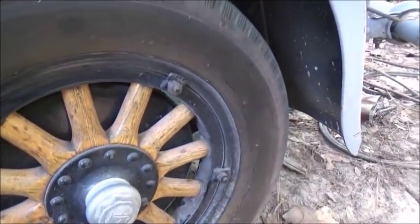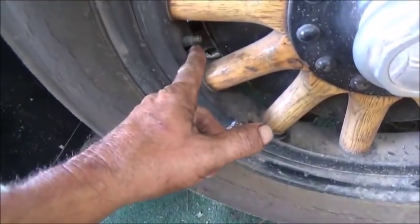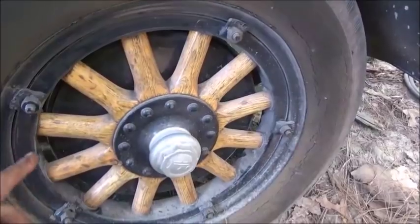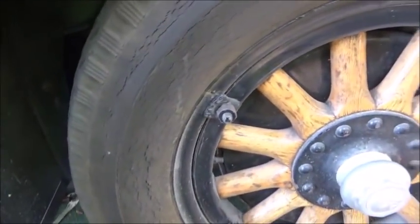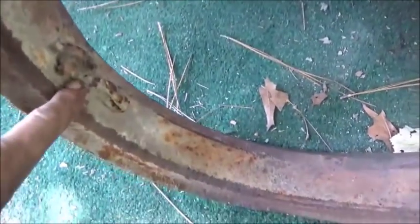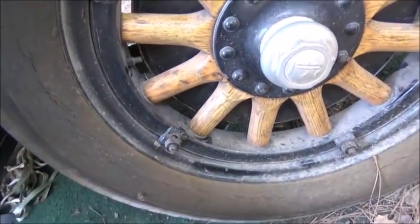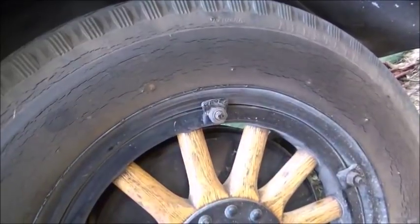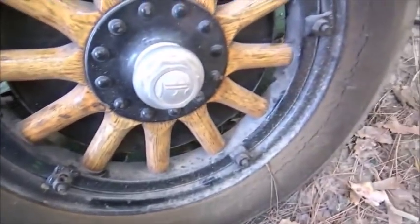The bend radius on the original is a short bend compared to a newer rim. But if we can make it work - weld it up good, grind it - we'll have to have an extra hole for the valve and it's got to be open on the inside where the rim splits, because that clamp needs room to go in. Once that's done it just takes three holes in it to hold it onto our bracket. I'll run in and check if I can find some of those Haze hold-down clamps.